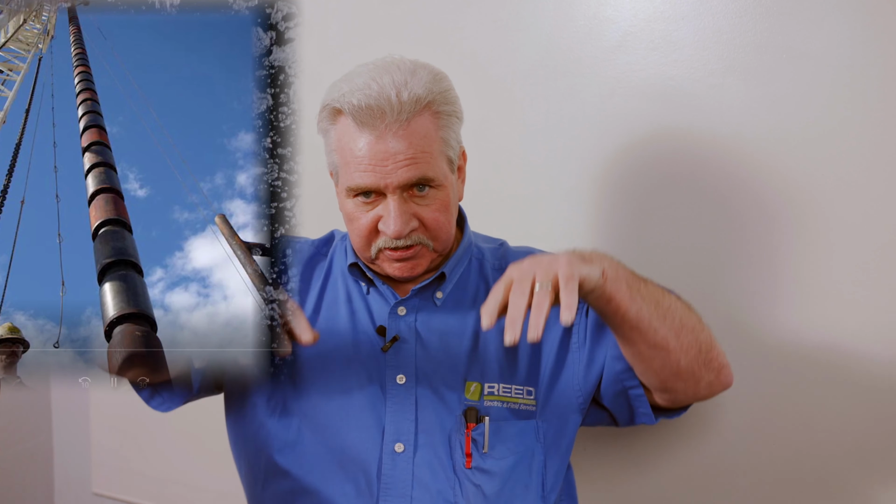The geothermal world is a lot different. If you can imagine seeing a motor sitting on a pump base and having a cord come off the motor for the power and having a loop in it, and the next day coming after that motor has started up and the well's gotten hot and the loop is now almost straight, that's how much thermal growth has moved in this whole unit. The bowls for each one of the pumps that you saw, that large pump hanging in the air, has a wear ring that big. So that's how much wear ring that these pumps can move up and down. It's a good 8 inches that it can move real easy in the thermal growth.